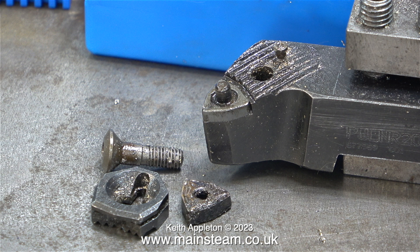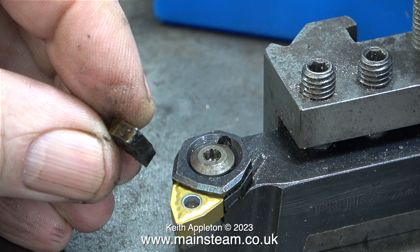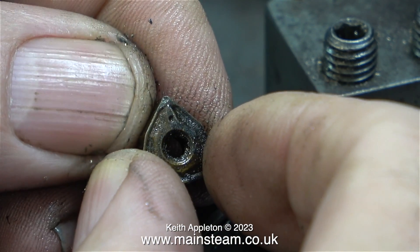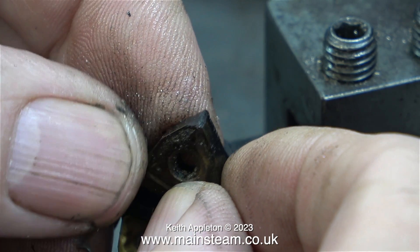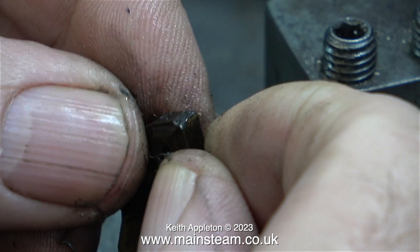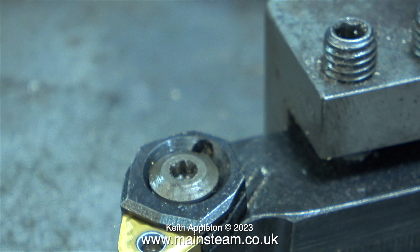I've roughly cleaned it with a stiff brush and it's looking a lot better, but really I should have cleaned it properly. These replaceable carbide tips are not cheap. And not being a machinist but just an interested amateur, I need carbide tip tools that will allow me to change the position of the tip as each surface gets blunt. The good thing about these tips is you get six goes from each and every tip. As I rotate the old tip, you can see how beaten up it is — there's only one surface capable of doing any cutting, and even that is a bit blunt. I always try and buy this type of tip where possible, just from an economy point of view. The smaller lathe tools I have only allow three surfaces to cut, but generally they are not brutalized as much as this one.